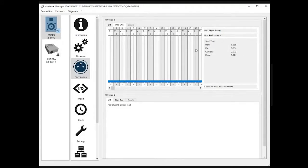The information on the right side of these faders is something you might not have to use, but sometimes it is needed. I don't want to get too deep into DMX, but there are several possibilities to make DMX controllers, especially receivers, and sometimes the DMX signal might be too fast or too slow, even if it's in the norm. There are 2 points, A and B, for the DMX controller. You need to be somewhere between those points A and B, but for the receiver you need to be able to read everything from A to B, and this is sometimes not possible with some devices.